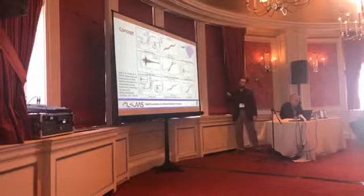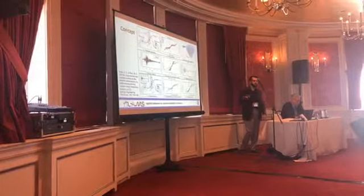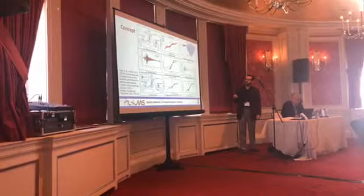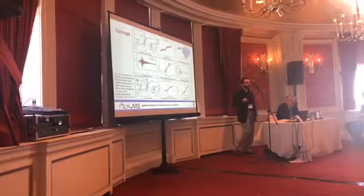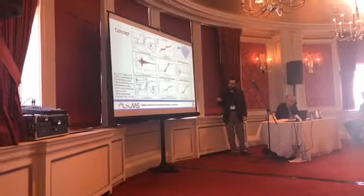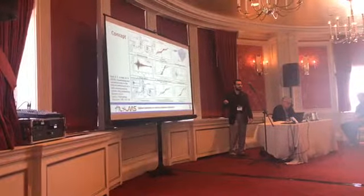Now, after we have this building, we can subject it to different ground motions, different intensities, and then this is followed by the fifth step, which is acquiring the data that's obtained from the different ground motions in terms of force and deformation.